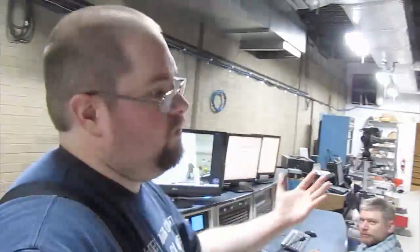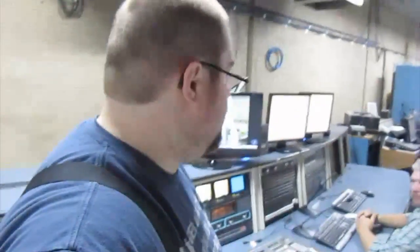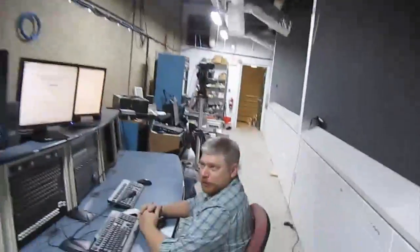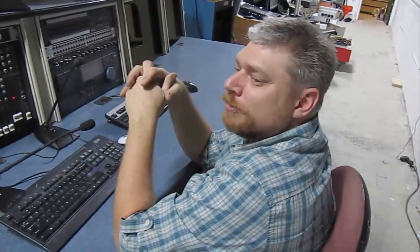All of the equipment down that way towards radio is now ground isolated. And we've directly connected it with this wonderfully long white cable. And we still have a grounding issue or interference issue. It might be something with the cabling up across the room there, but by throwing it across the floor, we eliminated any kind of mutual inductance issues or anything like that. So kind of at a loss.